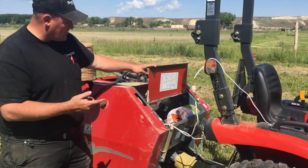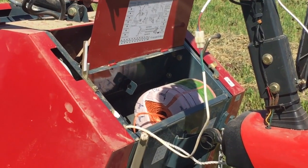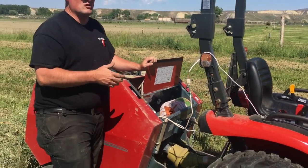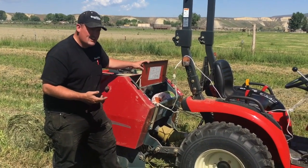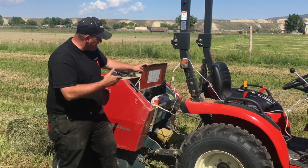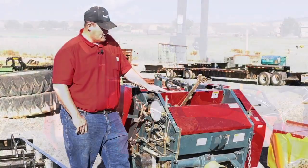This is an actual poly twine that comes in two bundles — you buy 9600 feet and it's 170 pound knot strength twine. We ran this through the baler; it picks it up great, goes right through the chamber, works fine. So there would be absolutely no problem if your local tractor dealership sells 9600 170 or even a 9000 170 — any of those bundles should fit right in the baler.